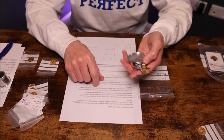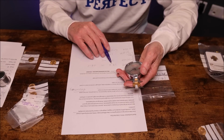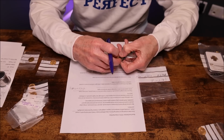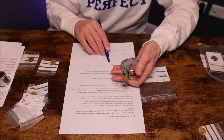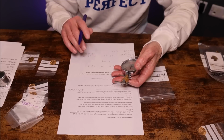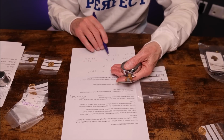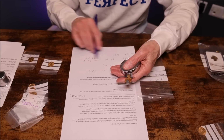And just looking at the diameter of this, I've already done a couple of readings before we started. If you rotate it when you're measuring it, you should get more or less the same reading all the way around, but experience tells me you often don't. The readings there are coming out between 19.7 millimetres and 20.15. A genuine one should be about 19.3, and I did check a genuine one there, and that's coming out between 19.31 and 19.2, that's also a lot more consistent.